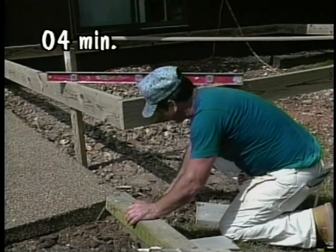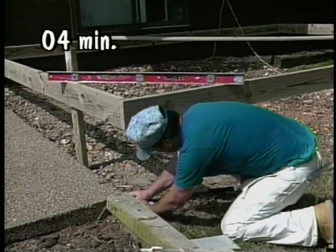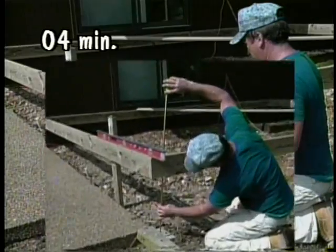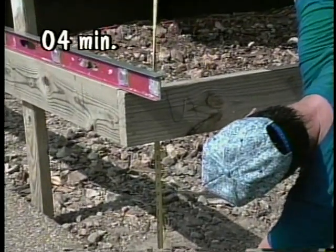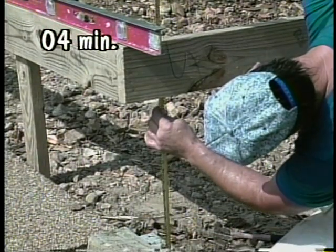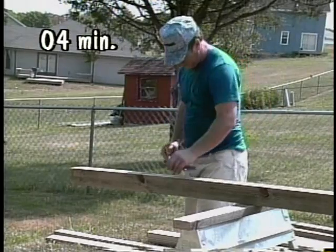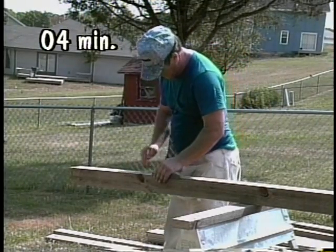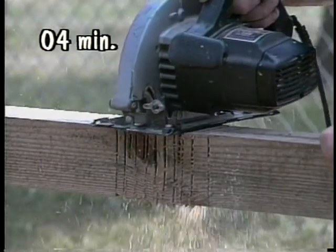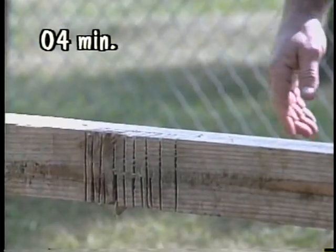We will place cinder block halves on the ground for the 6 4x4 support posts to rest on. The posts go from the ground to the top rail and will support the deck. Measure for the notch cut that will accept the perimeter board. After marking your measurements, cut slits in the post between the markings and remove the wood. Be sure you take accurate measurements so your deck will remain level.